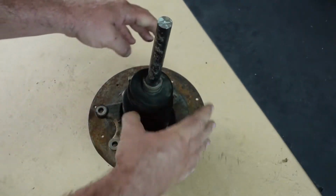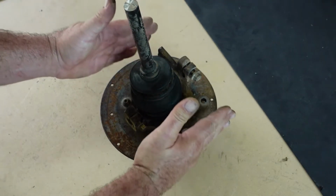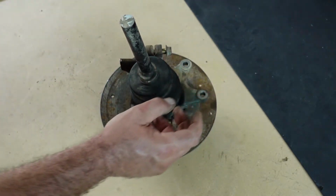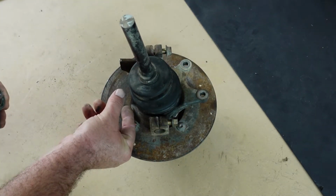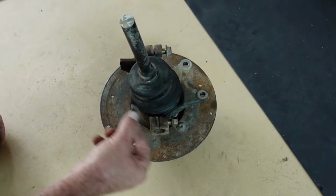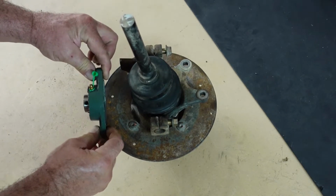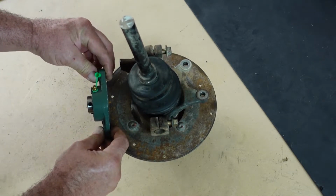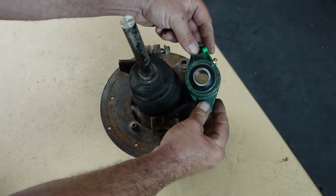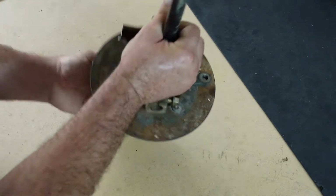The next step here on this is going to be building a bracket, basically a knuckle bracket, that's going to sandwich it here, and then I'll be able to weld a 3/4 inch shaft off one side and the other side. It's going to be fun getting those lined up perfectly. And then these bearings are going to be out on the shoulders of the robot on the frame, one on either side. And so that will give it this motion here.